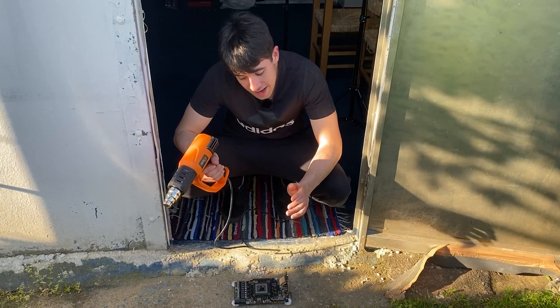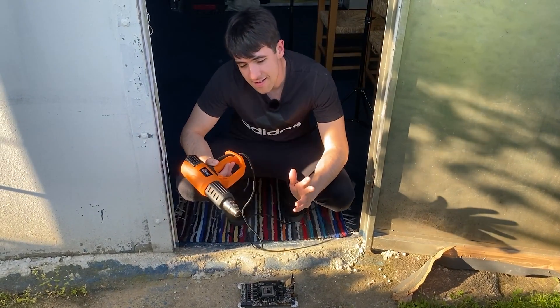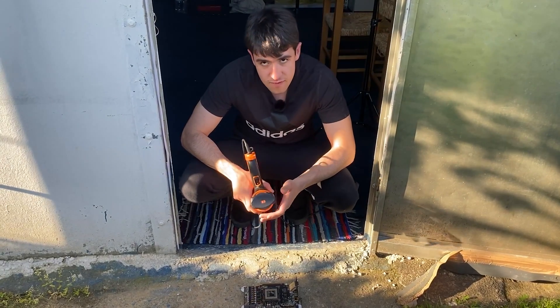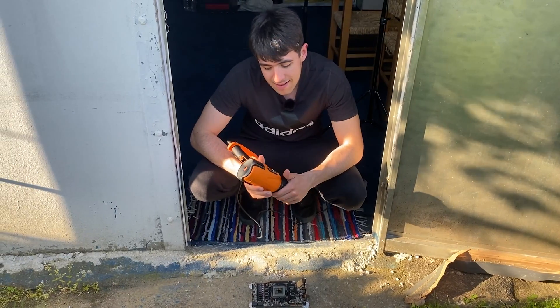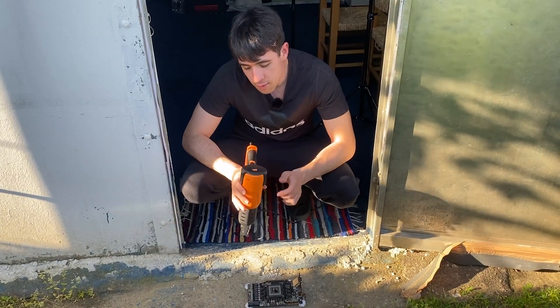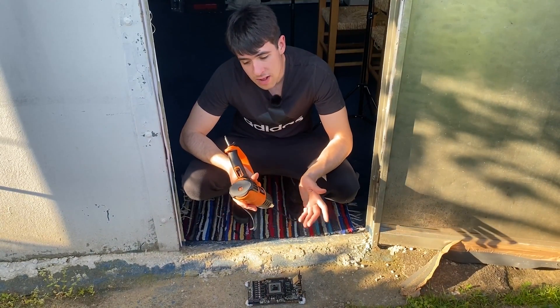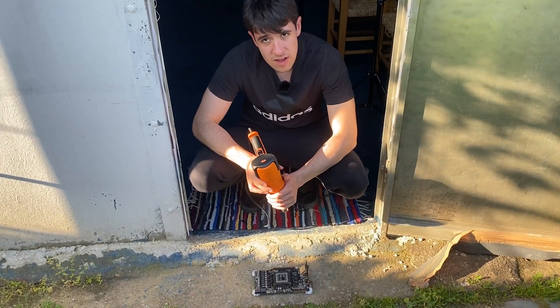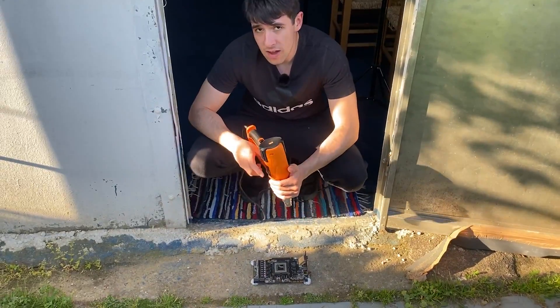The last step is to heat it up. I have a heat gun — this is kind of like a reflow. I'm setting it to six out of nine, which should be around 600 degrees, at two-thirds speed, and I'm going over it for about five minutes in circular motions. You can also use a hair dryer — you just want to heat up the card a bit. Let's go.